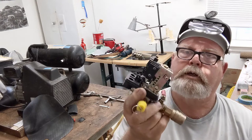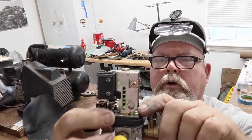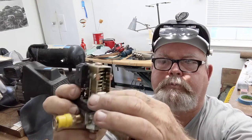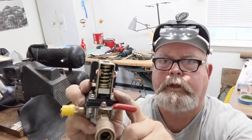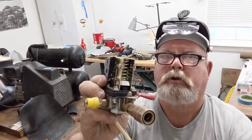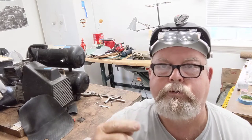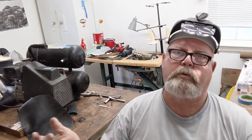Take your patience on this. Make sure you lift the arm up and pin it off in the back so the tension is off before you remove the screws and nuts — it'll save you all kinds of grief. If you don't, you'll want to toss it in the trash. I fought this from about 10 o'clock till one o'clock trying to get that spring back in and gave up. Now if I want to turn it off, I just unplug it.